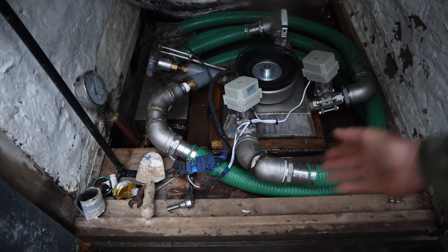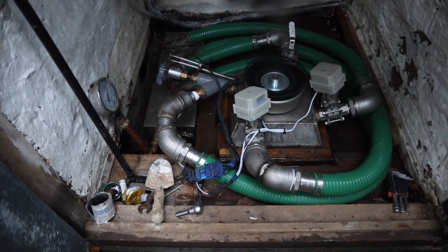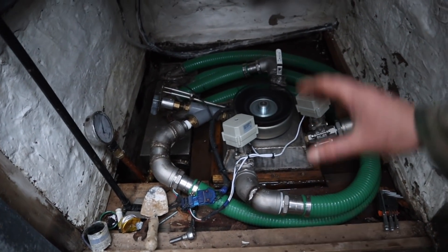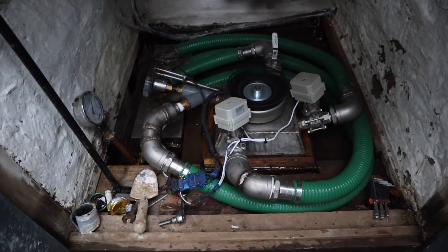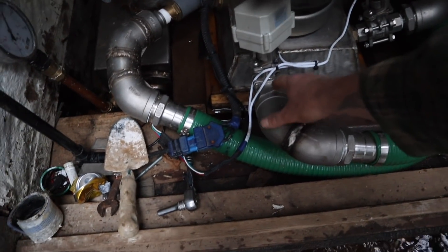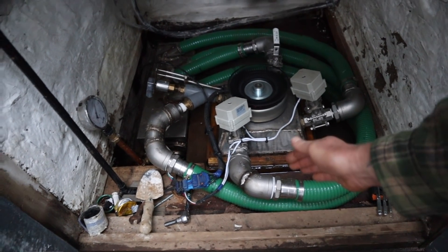This system is sized to have very small pipe losses, and that's why changing that fitting makes no real noticeable difference. If I put it completely straight we might get one or two watts, but because the pipe is so oversized it's just not going to make enough difference to be worthwhile — I won't be changing the other two. So: if you want to use really small pipe in a turbine you have to think about these things in depth and really go straight with no curves. If you go really big on the pipe, those things make such small differences. There are other places where you can make better, more significant changes. I think we might have better luck improving this sharp edge in this fitting here — we might do that next.